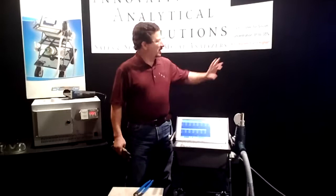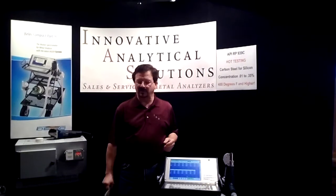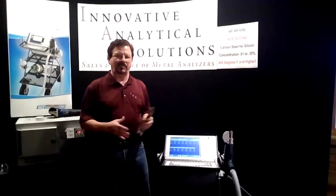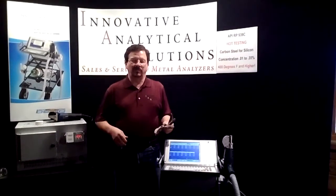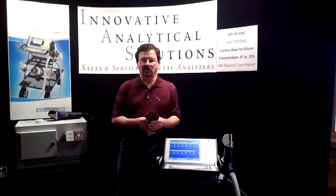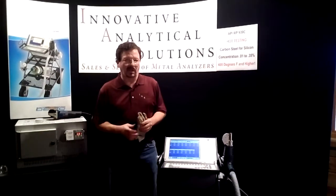So that's the ability to address the silicon testing for sulfidation for API recommended practice 939C. In our next video, we're going to show you the ability to hot tap using a spark probe. What the hot tapping will do is let us test with this instrumentation in spark mode of operation up to around 400 degrees. So 400 degrees is the cutoff between arc and spark. We're going to shoot some material at 350 degrees Fahrenheit in a spark mode of operation, which will give you a complete chemistry.